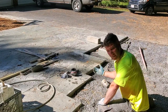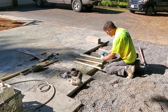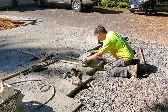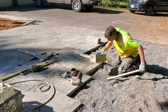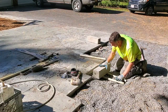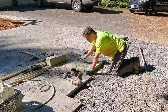That pretty much concludes everything tool-wise. Safety is important. The last thing is the rollers — if you have a stone you need to pick up and move, you can put it on the rollers and pull it out of your pattern, set it up on the section you've done, and slide it either direction. You can also use rollers in the gravel to get a stone where it needs to go and then pull them out. I don't use these as much — it's really the digging bars and six-by-sixes, even a four-by-four would be nice.